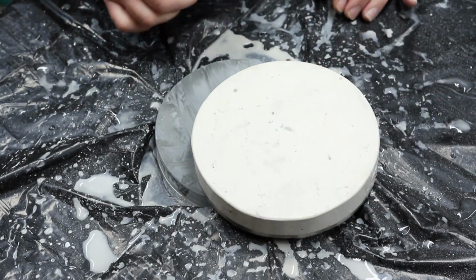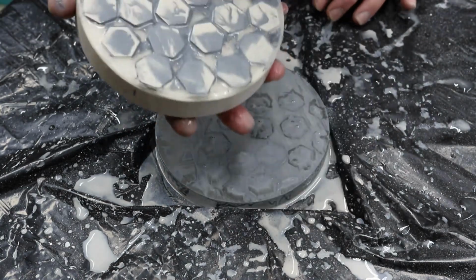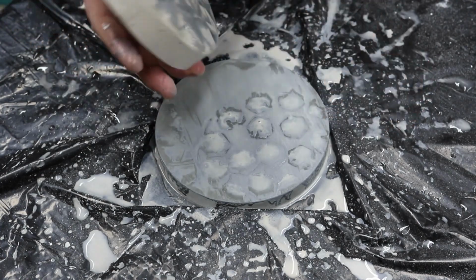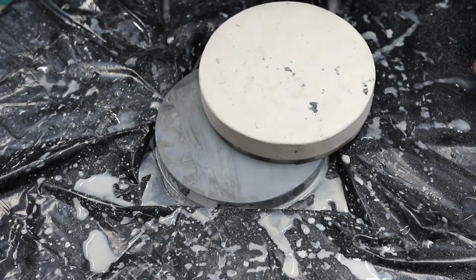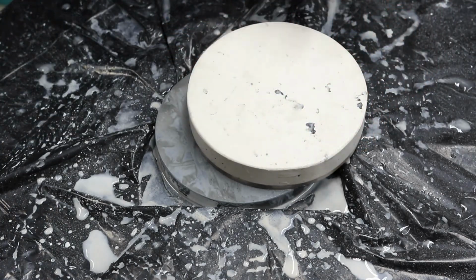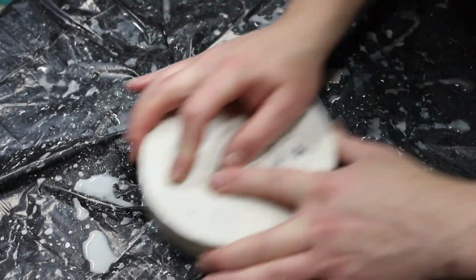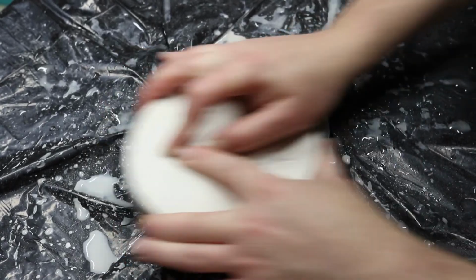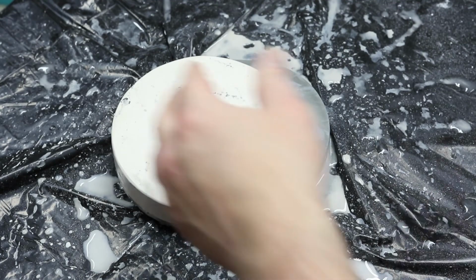Oh no, it chipped. It chipped. Shoot. Okay. So, yeah, I'm not exactly sure why that chipped out. I still have a good chamfer on there, but I'm going to have to be really careful. I could feel it grabbing a little bit, so maybe I just need a little more water, but that's not really great. I have a little chip there, but hey, first mirror. Probably put a little too much pressure on the edge of the mirror though.